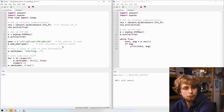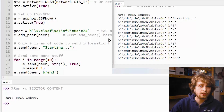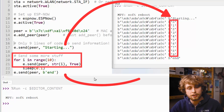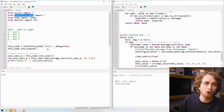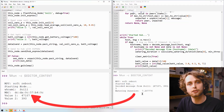Running both boards — starting the receiver first, followed by the transmitter — all those messages come across: we get the starting message first, followed by all of our numbers, and then the end message. This is ESP-NOW implemented in my final Plant Pulse project, using the same structure as the examples but wrapped up nicely in their own little libraries, passing through sensor values. We hope that gave you some insights and solutions for getting two boards communicating, either wired or wirelessly. We'll have links to guides and resources on how to set all of those up. Happy making.